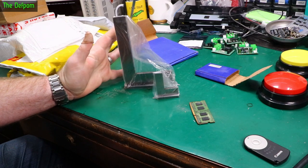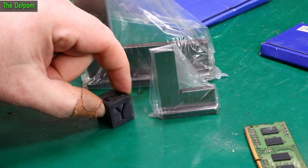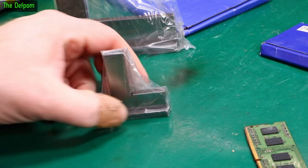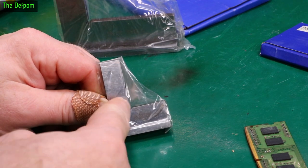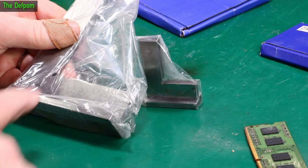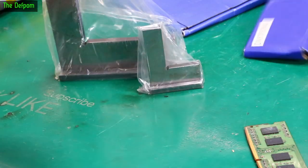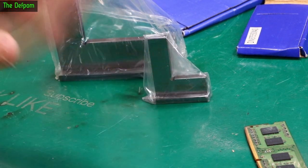There's been many times I wished I had some small squares — not to be confused with a small cube! The great thing about squares is you can do a vertical check off a flat bed, and you've also got the inside angle, with a little cutout relief so you don't have a corner stopping it from seating nicely. You can check the angle along the outside by putting this around something. These were really cheap: this one is 150 by 100mm and this one is 50 by 40mm. You can also get 45-degree versions.